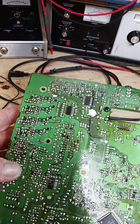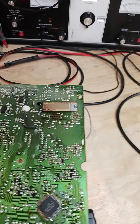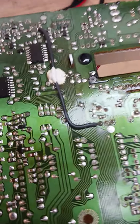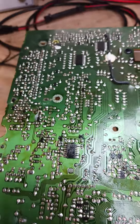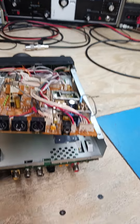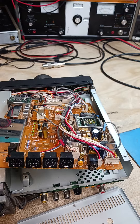While we're at it, we're going to reflow all the soldering because I know they've got a lot of bad solder joints — it's just notorious. The other biggest issue — right here is your external speaker jack. I can see a fresher solder joint on the side; these are not good solder joints, so we'll touch that up as well. I'll do an updated video when I'm all said and done and show you where I mounted that power resistor and how the wiring is dressed nice and neat. We'll get it all up and going — DX Radio Shop.